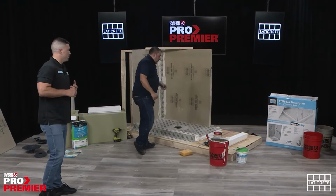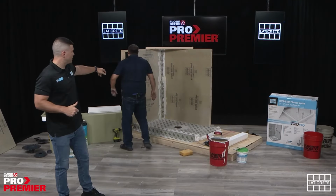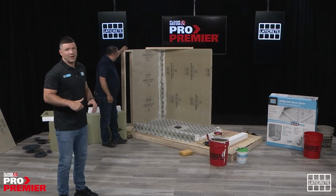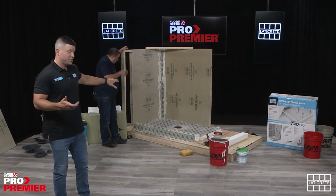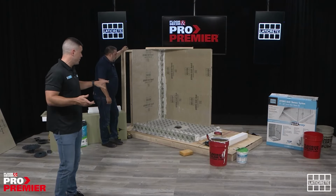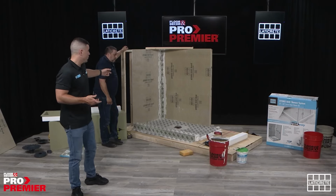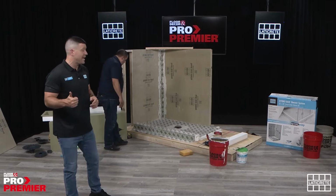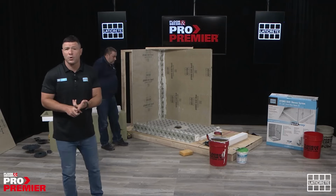All right, so now we've adhered the board, we've treated the first vertical seam, we've adhered the sheet membrane, we've installed the drain. Now for time purposes, obviously you would wait for the thin set to cure to get on top of the sheet membrane. But for the sake of this video, we want to speed it up a little bit. So what we're going to do is show you two other options that we have for seam treatment, or three other options because we have the board there, show you how to seal off some of those nails, and then theoretically you'd be in a position where you're ready to tile both the wall and the floor.